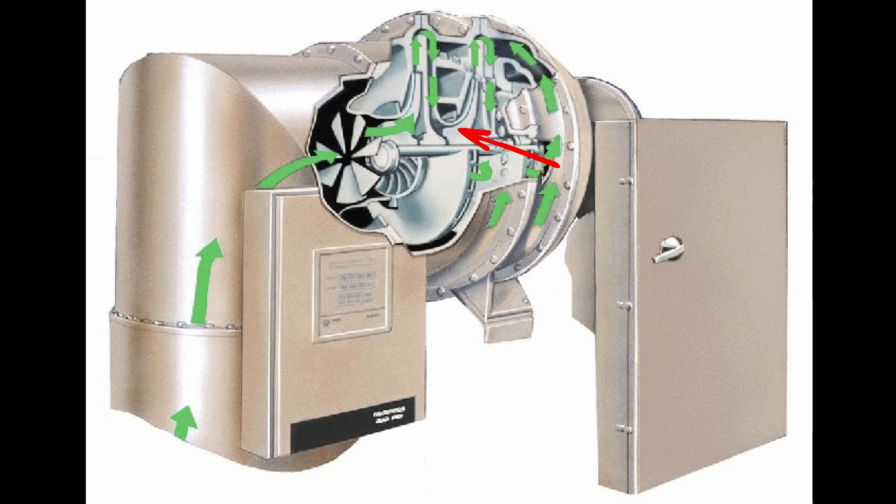The difference between a CVH-E and F is how many stages we have in the compressor. What is depicted here is a two-stage compressor, meaning that we have two impellers. You can see one here and the second one back here. Then it's going to go straight to the condenser.